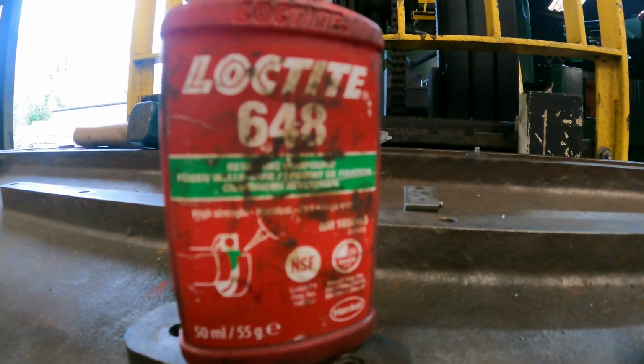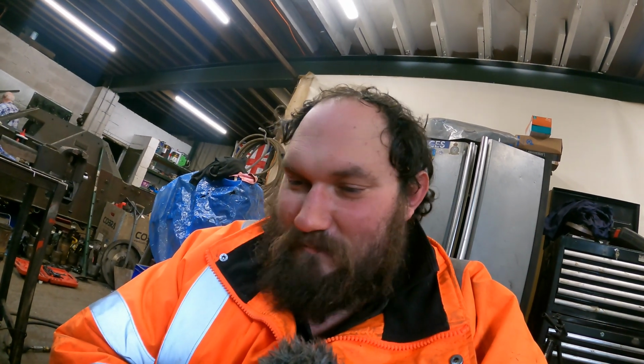So how are we going to seal them in? Our plan is, with our Loctite 648, and that is a permanent retaining compound for cylindrical parts. And our bolt is cylindrical. We weren't necessarily sure what the stuff to use was, and we've done Googling and Googling and Googling, and nothing really helpful comes up. There is an article online, Loctite did on Ford using 643 in their production plant on core plugs, threaded core plugs, and reference 648 being more expensive and better in higher temperatures.